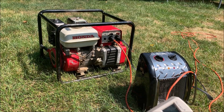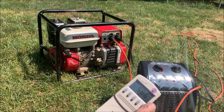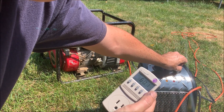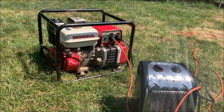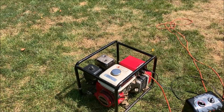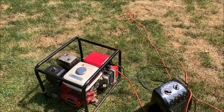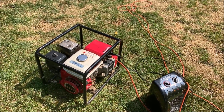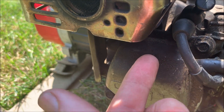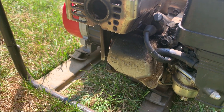It's right around 60 hertz with really no load. We'll try a 1500 watt load and see what happens. That's pretty good. It started really easy and I was able to turn the choke off. It's not running perfectly — I tried choking it a little to see if that made a difference and it didn't. It's almost really not worth digging into because it is running quite well. The other issue with this exhaust and carbon buildup — I put my hand right there and it was very hot air blowing down right onto the cover, so I think there is something going on there.